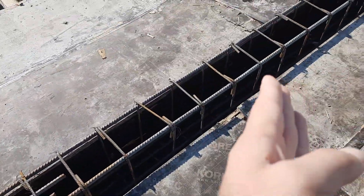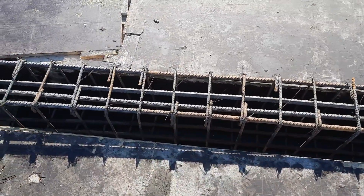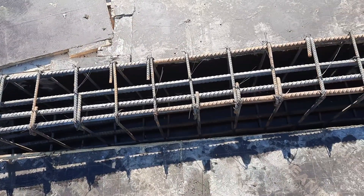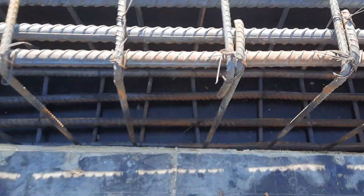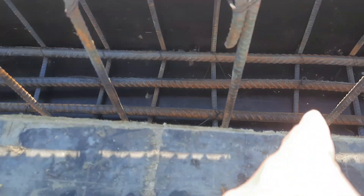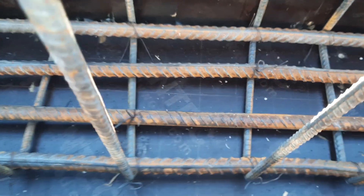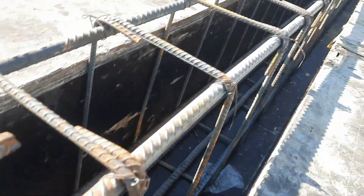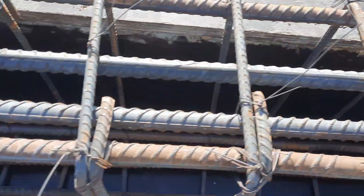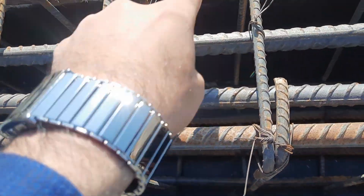You can see this is section A-A where we have negative bending moment. At the middle of the upper section of this beam we have two extra steel rods — diameter is 16 millimeter. At the bottom we have four bars, at the top portion we have two bars, and two additional bars are provided at the middle to resist negative bending moment. We have two sections — one at the distance of L by 4 and the other one after L by 4.